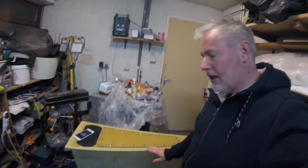The question to ask is, have I finished with my fuel tank? Pretty close, but not yet. I think there's going to be one more fuel tank video, maybe fuel tank part 4, because I need to now look at how I'm going to fasten this into the keel. Before I can do that, I need to go back to Wanda and laminate the inside of the keel, because that's probably going to add another 1 or 2 millimeters thickness back inside there. So I need to get that right, laminate the inside of the keel so that the keel or the bilge is done. Then I can fit the fuel tank in there and look at how I'm going to fasten some fixings there. And that's going to be the end of the fuel tank.